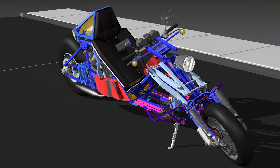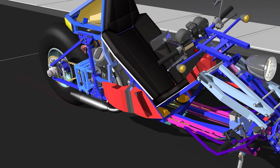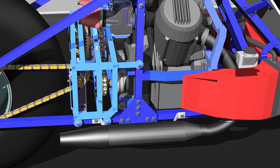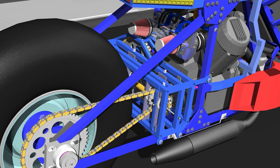This component is one of the more difficult parts of the build and not something you'll typically see in other builds, either Kaneda bike replicas or motorcycles. Since my rear wheel is significantly larger than a typical motorcycle wheel, you can't just directly connect the engine to the wheel. All the gearing ratios and torque will be off.